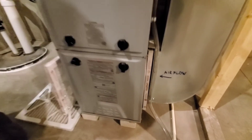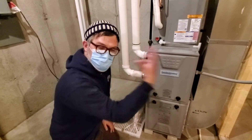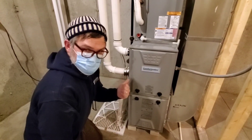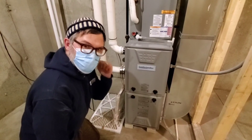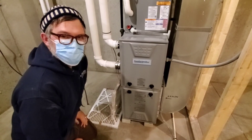Just make sure that you're doing all this work while the furnace is not blowing. You don't want to take the filter out and risk getting any dust into the furnace. So if it's heating season and your furnace is on, turn it off at the breaker, exchange the filter, then turn it back on and resume being cozy.